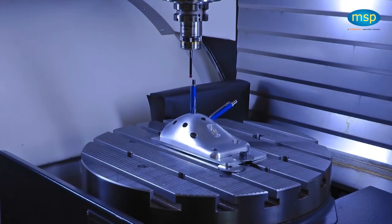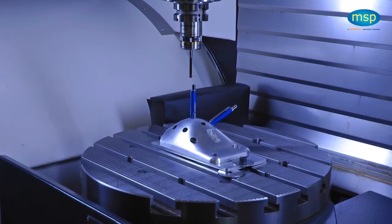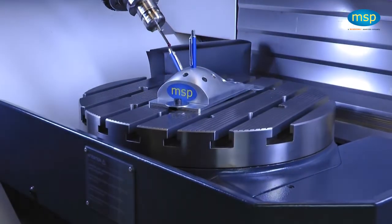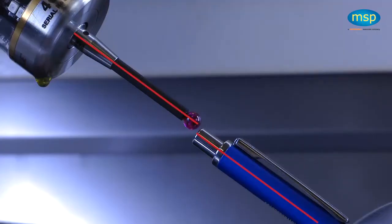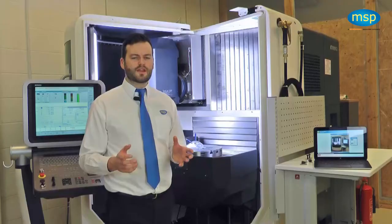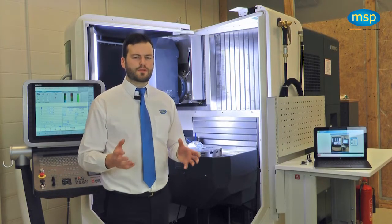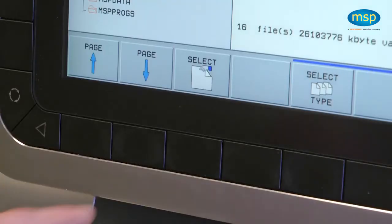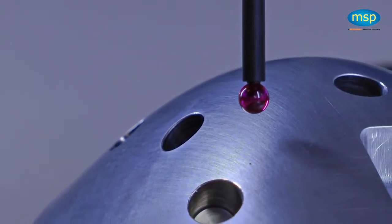We have also used two pens to show the misalignment over a greater distance to make it more obvious. NC Perfect Parts uses a probe to find where the part is actually located. We use a probing program that has been created in the same CAD CAM package as the machining programs. This is to guarantee it is of the same quality and for the benefit of the programmers. The program is loaded to the controller and run just like any other part program.